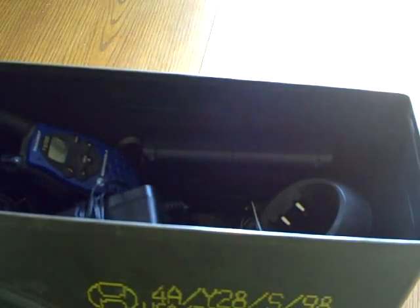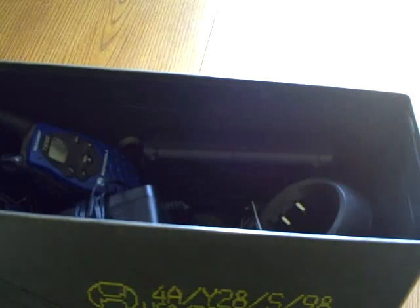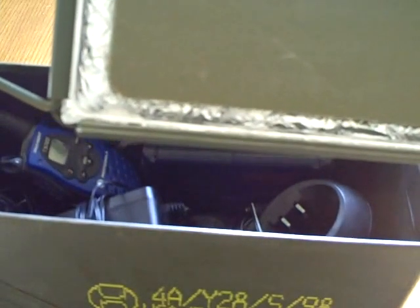There are sensitive electronics inside this can — radios, ham equipment, etc. These will all survive an electromagnetic pulse because the pulse itself will run on the outside of the can. It is absolutely critical that the lid is electrically connected, allowing electron flow over the whole surface, and that nothing inside actually touches the metal of the can, or it will create a direct short. This can has been totally lined with foam so nothing inside touches the metal.